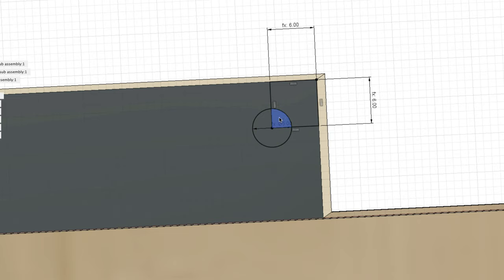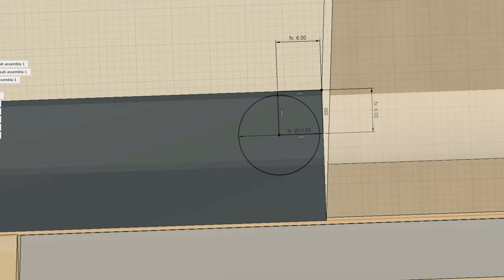That's made it 11mm — a 12mm diameter minus 1mm — giving me the step down and profile I'm looking for. Finish the sketch. I now want to take that profile and sweep it all the way down this edge — we used the sweep command when we made the top of the bookcase. So: Create, Sweep. The profile is that little block we've just cut in, and the path goes along the edge. I want to cut that out.